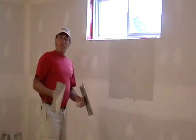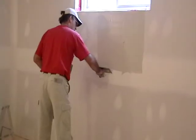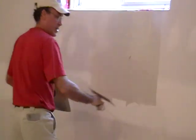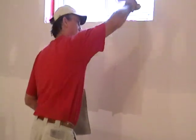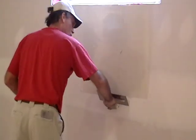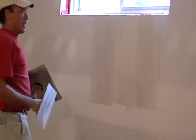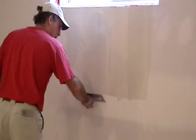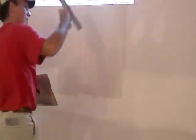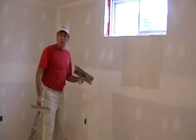Now on this coat you're not leaving mud there, so you will tilt your trowel up. We'll start with the edge and put pressure right at the tip of the trowel - it's tilted up pretty high and feathers it off against the board on that side. On the back, I put pressure on it and it's feathered off that side, so any edges have disappeared. Now we'll tilt up higher for the center, and that skims out all imperfections - any lines, any bubbles, any waving. Come back and tilt up and do that one. That's actually perfectly smooth to a point that sanding is just a matter of wiping, not scrubbing your guts out and making a lot of dust.